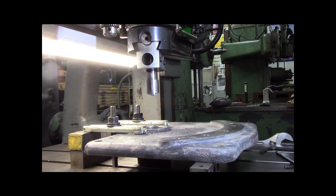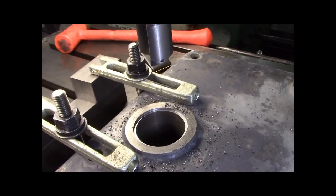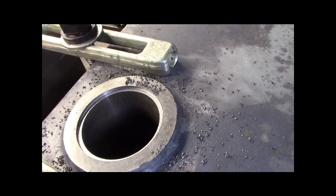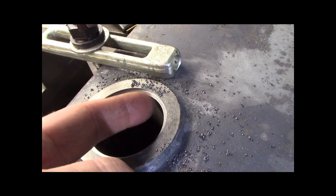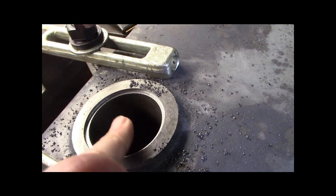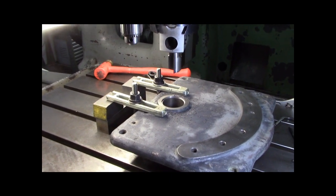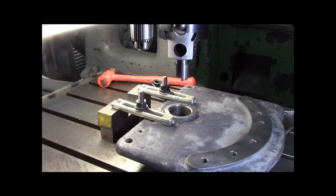Maybe you don't got the greatest perspective for what I was doing, and I'm sorry about that, but this tripod does not tilt. So that's what I did. And the reason I did that, I did a face O-ring, not a one in the bore, because there's a groove in the surface here. An oil groove. I'll show you when I break this down. But that's what it is. And that's the job. It was fairly simple, but at least I got to use my SIP jig bore.